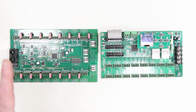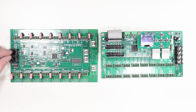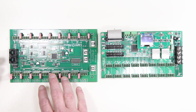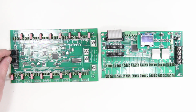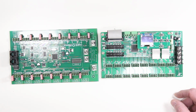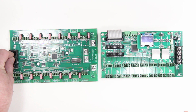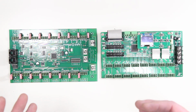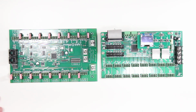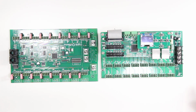Now it's not uncommon to have pixel megatrees with thousands of pixels on them, and that means that this kind of interface is not suitable. Now, it is a Cat5 jack, but that does not imply that that is what is called Ethernet. So this is an RS485 connection. Now, that means that our total bandwidth on this controller is roughly somewhere between 500 kilobits and 1 megabit. So if your regular cable modem is 50 megabits a second, that is 1/50th the speed of your cable connection. So this is something you would have had back in the day with dial-up and that type of thing.